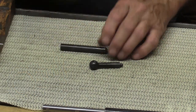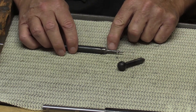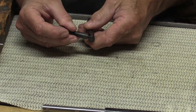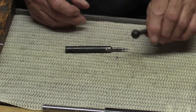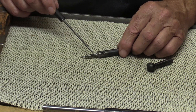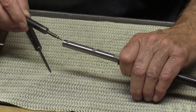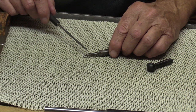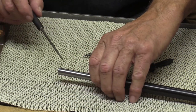Here's our bolt. We started out — you remember — we took out the .177 bolt, and I happen to have a .22 caliber bolt, so we annealed it. We pulled this out; it's basically just a press fit in there, so we'll get some Loctite and press that back in. We machined the neck here down to a little under 200 thousandths for .20 caliber — we took it down to 197 thousandths and it fits in the barrel pretty easily. Then we had to cut this groove for the O-ring, and we decided to put the O-ring on the bolt itself rather than on the inside of the barrel, just because I hate changing the O-rings in there.